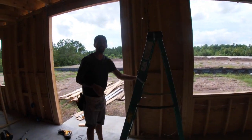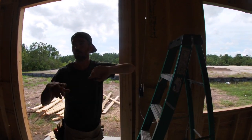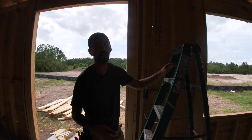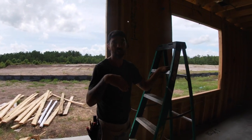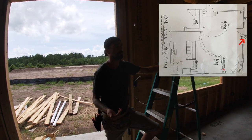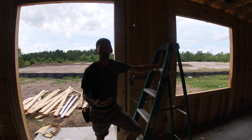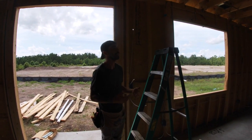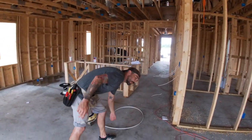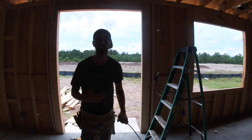Here at the back door, there's no covered porch, so all it's getting is a coach light — no floods or anything. All we've got to do is stub one out of this OSB, and then we'll get back to it when it comes to finishing. Depending on what siding you get, you might need either a 3.5-inch pancake or an octagon box — it depends if you've got vinyl siding, hardy plank, or brick. If you've got brick, that's a whole different thing, but we'll get into that when we start finishing up pipes.